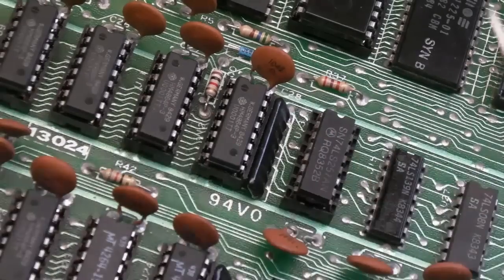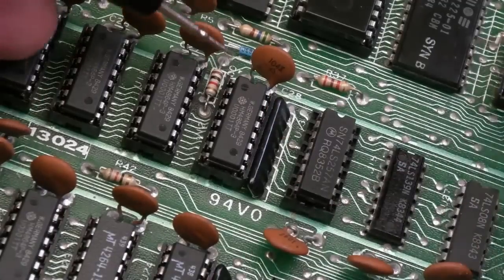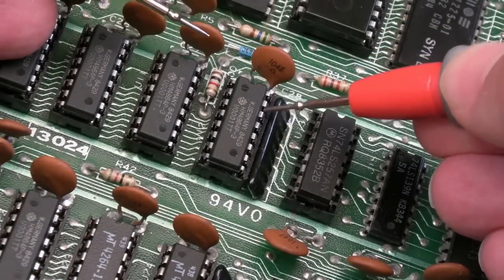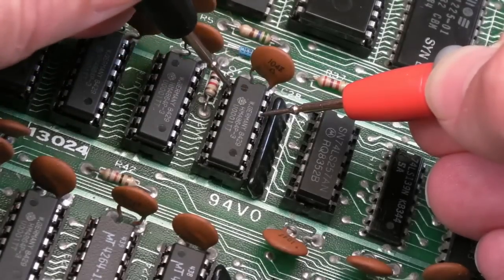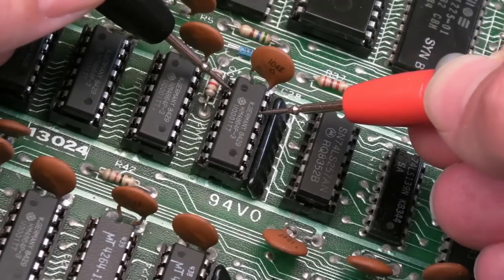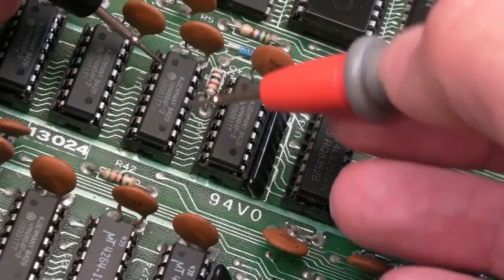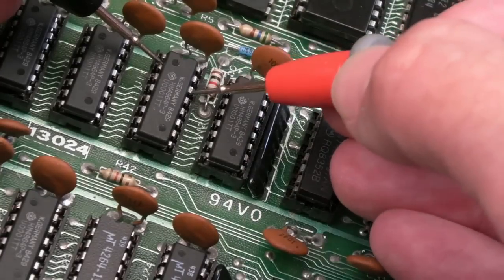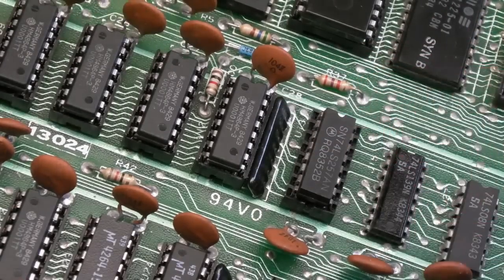Yeah, quick clip added in at the end there. If you didn't follow the annotation there, what I was trying to explain, when I said that's the data in, data out pin, no, it's not. The reason the third pin down this side was not beeping anywhere, you know, they're not joined together, is because that's the data pin as well, they're joined together. See that? Yeah, the D pin and the Q pin are shorted. So that's another check you should do on each chip. Because if those were broken, you may find its data in is connected to the CPU, but its data out isn't. So on each chip, those two pins will be joined on a 4164.